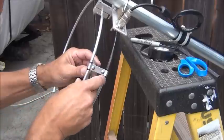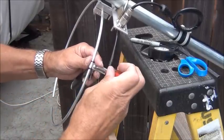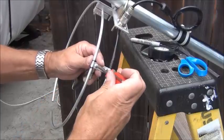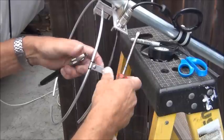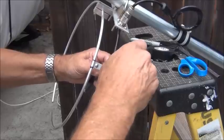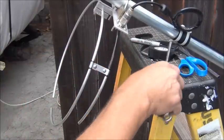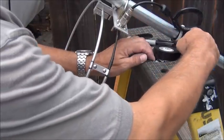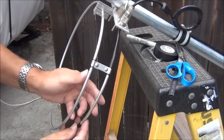I'm going to cinch this down tight enough so it won't come loose later on. Remember, these screws and hardware are made out of stainless steel to keep them from rusting. The next thing is I have some little vinyl caps to put on the end here to seal this end of the gamma tube.